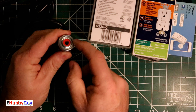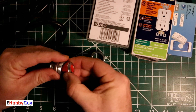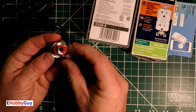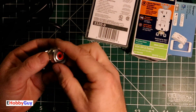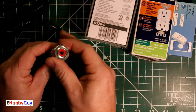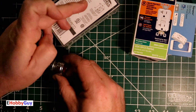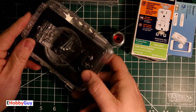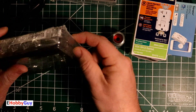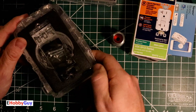This is a half inch MPT power cord grip. There's a little rubber grommet that's tapered, and the surface inside is also tapered, so it sits in there and a little nut slips over both. We slip the cord right through the middle and it makes it watertight — providing a watertight fit for the cord to get through into the box. And finally this is just an outdoor cover. The plugs I'm using are just outdoor LED Christmas lights and I don't need too much space, so this should work out just fine.